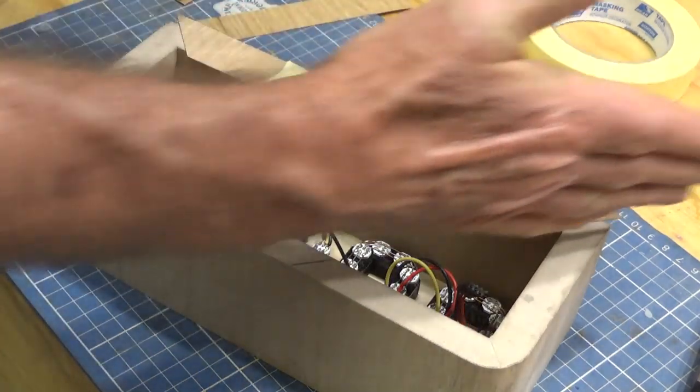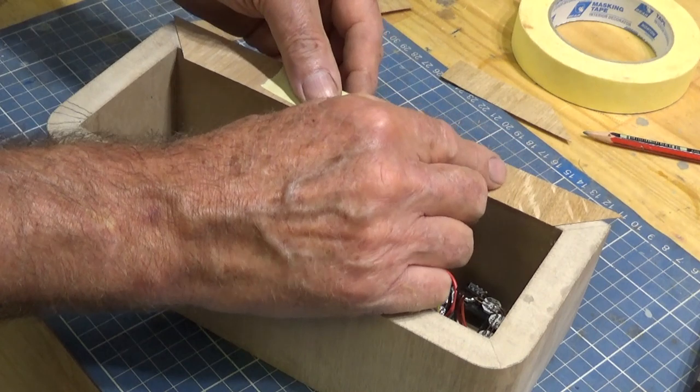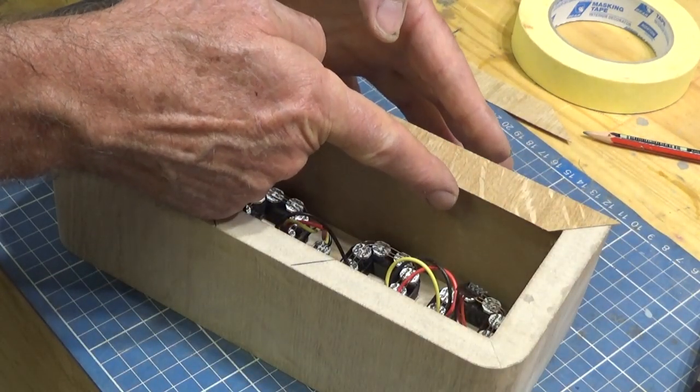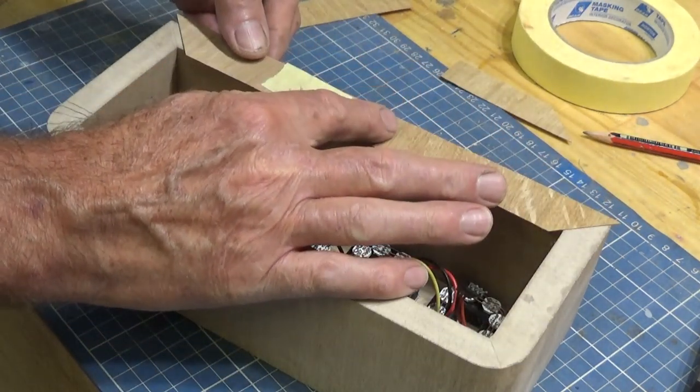And because of the taper on the two mitres, we can match it up with the existing carcass. Now, that's why I cut my veneer much wider than what I wanted it, to give me that little bit of wriggle room to adjust everything when we're finished.